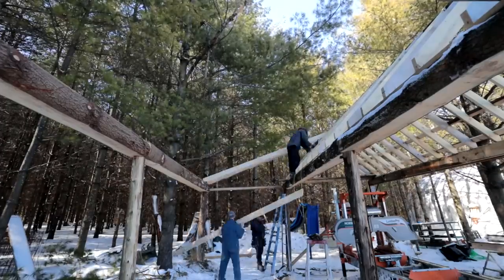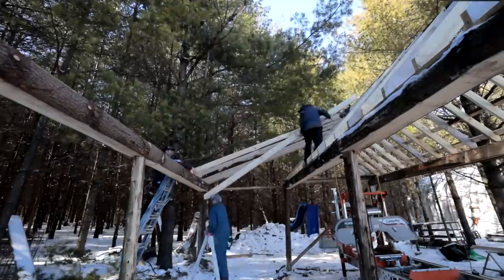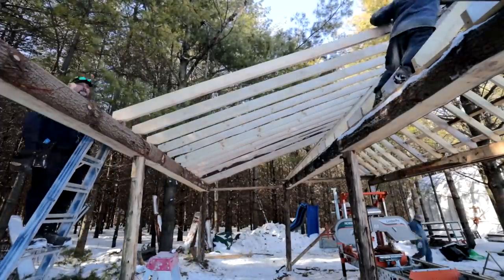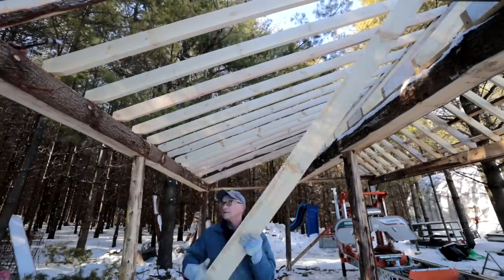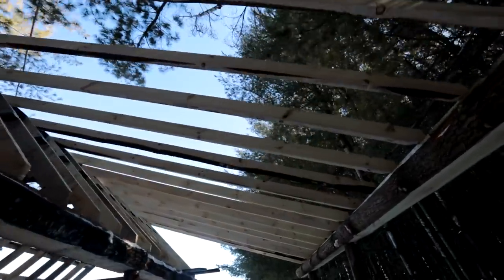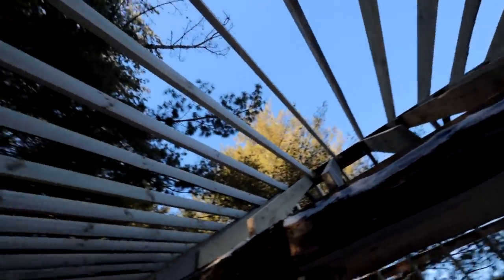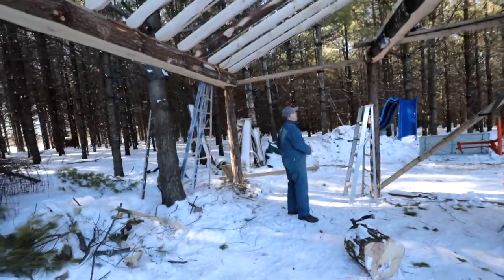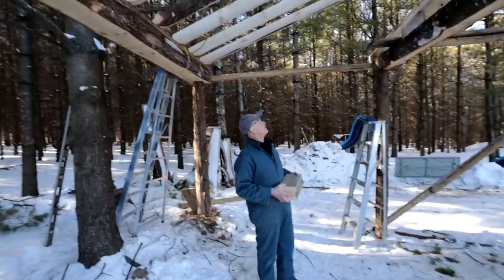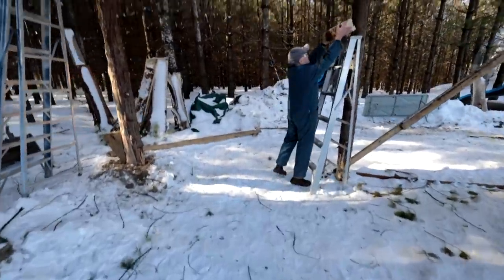In order to set our back roof we ended up using a lot of 15-foot two-by-sixes. We started from one end nailing up the ridge, and then at the back we added a couple more nails and worked our way from the back to the front going one at a time in order to complete our overhang roof. Looks good - looks very good, looks big. We got some blocking and some strapping and we're all set.